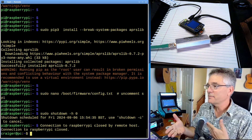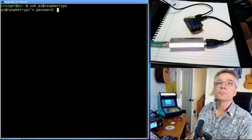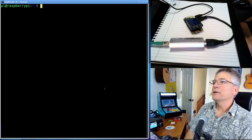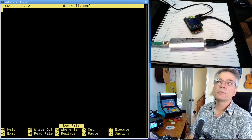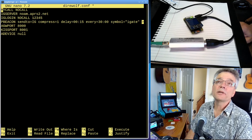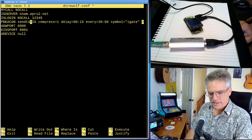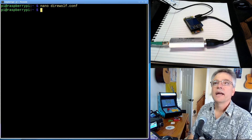I'm going to remove power, put this monitor on here, make sure the pins are lined up on the headers, then apply power again. Now we've got our hardware all assembled. Once again we are going to SSH out to the Raspberry Pi. We need to create a direwolf.conf file — I'll do nano direwolf.conf, just in the Raspberry Pi user's home directory — and paste in a handful of lines. My call is NOCALL; if you're an amateur radio operator put your call sign where it says NOCALL, and also put your APRS passcode right there. Hit Ctrl+X, Y, then Enter. Now we have direwolf.conf.